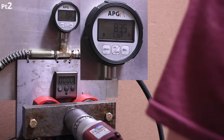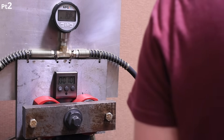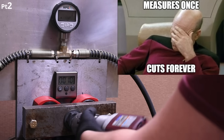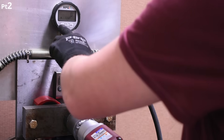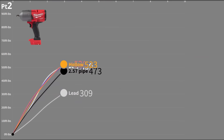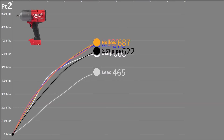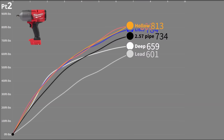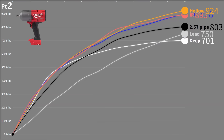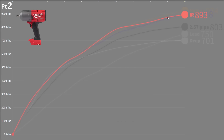As usual, these effects also apply to cordless impacts, which we were able to verify, but just to a bit lesser degree. We theorized this is due to each impact blow being less impactful on cordless, which uses a ball and spring cam mechanism, versus an air tool whose whole mass completely stops with each blow — a more efficient transmission of that potential energy.